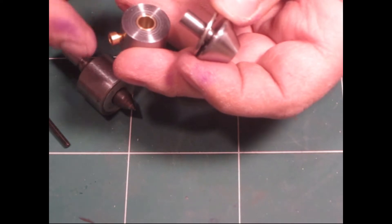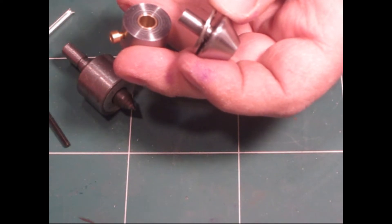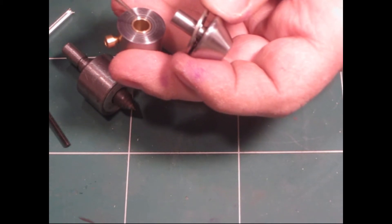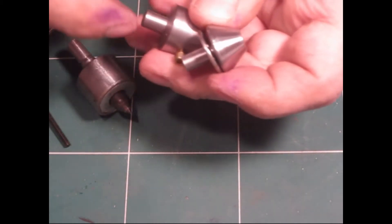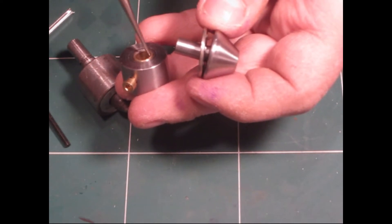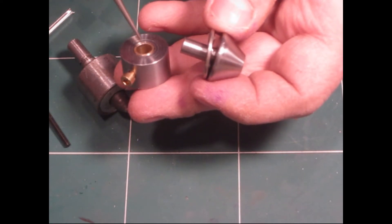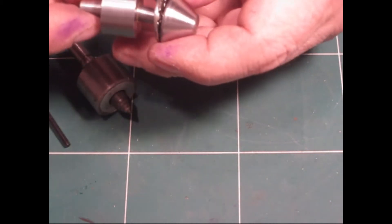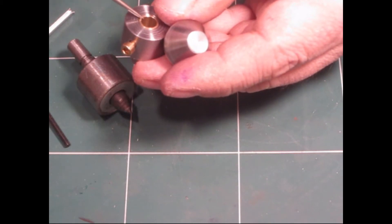The basic idea is very simple. I've used a 20mm outer diameter steel shaft — it's a transmission rod. I have an 8mm drilled and reamed hole in the middle. It's a blind hole; it doesn't reach all the way through, because we need the tail to be held by the lathe chuck. What I have here is a brass bushing — 6mm inner diameter, 8mm outer diameter — which is the part that will suffer all the wear and tear. The rotation of the steel shaft in the brass bushing causes the wear, but the brass bushing is easily replaceable.